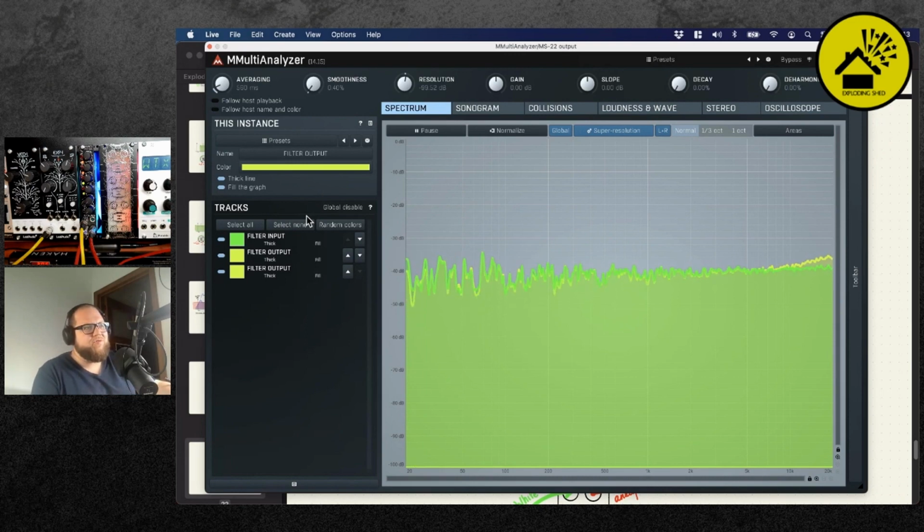And so I'm not calibrating my module now. I'm using a calibrated module to fake what it should look like. So for example, if this is a new module, not calibrated, I'm now starting to turn the knob of my low-pass filter. Nothing is happening, and now I see the peak. So I have some useless range, a range that's too much on the high side. And now I'm not at the physical end of the knob yet, but I can still keep on turning, nothing happens. That means that on the low side, the range is also too high. And so now at this point, I will reduce the gain a little bit.